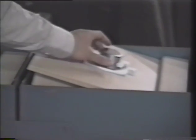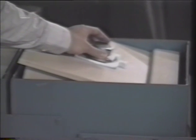The entry of these safes are designed so that no pry bar can be inserted in and the door attacked. Everything must be done by drilling. This is a better security safe than the ones we looked at. If you look, it looks like two 12-gauge steel welded together to allow the door, and all this is, again, insulation. If you notice the bolts, it's a 1/2-inch metal, very easy to get to.